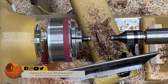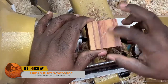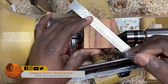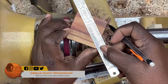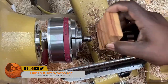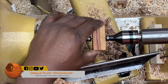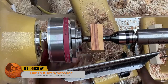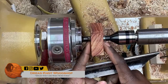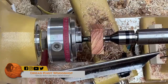I'm going to switch to overhead camera view. I have the centers marked on both sides — basically you go from corner to corner with a ruler or straight edge, mark a line, and do that from both diagonal corners to arrive at approximate center. This isn't a high-precision project, so it's not critical, but you want to be as close to center as possible to get the best use out of your material. I'm using half-inch step centers to keep things out of the way.